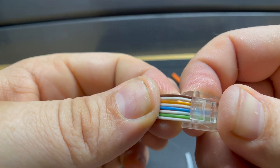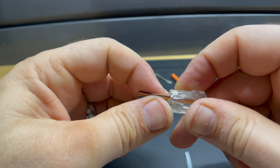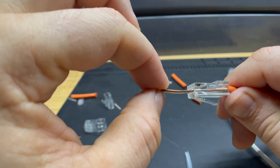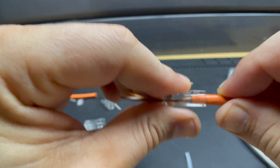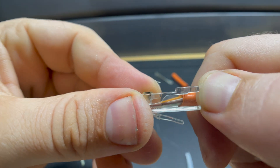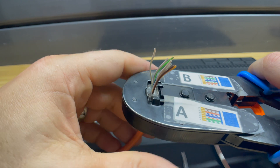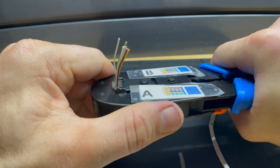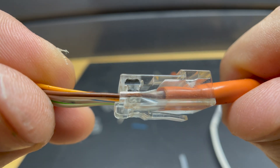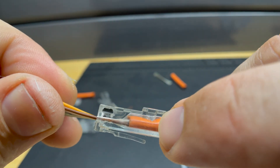The great thing about the pass-through connector is you can check that your wiring is correct before crimping. With a pass-through connector, you also don't have to worry about getting the inner wires to the exact correct length. Just slide the RJ45 connector on, making sure you get onto that insulation because you want that part of the RJ45 housing to crimp down on that outer jacket. Then give it a nice firm crimp, making sure you press hard enough so that the conductor comes down and touches the wire on all eight positions — that's what you're doing when crimping, and you're also crimping down on the housing.